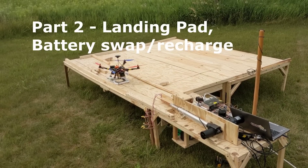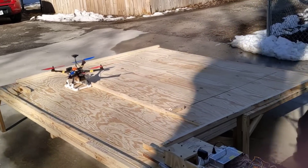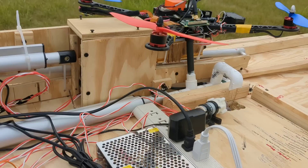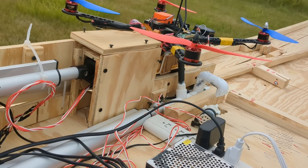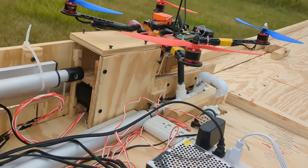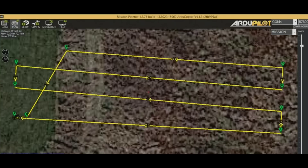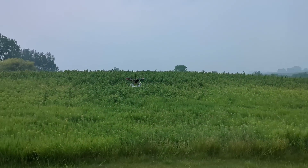Now let's move on to the landing pad. The drone can only fly about 15 minutes before needing a new battery, so we have to land and swap automatically. This is a big landing pad — about eight by eight feet — with two large arms that corral the drone into the battery swap and recharge station. Large motors spin threaded rods to move those arms. Linear actuators push out the old battery into a tray, the battery charger rises, and the arms push in a freshly charged battery; the spent battery is then pulled into the charging bay. The laptop loads a new flight plan, pushes the drone out, and it takes off. A separate build video for the landing pad is the second link in the description.